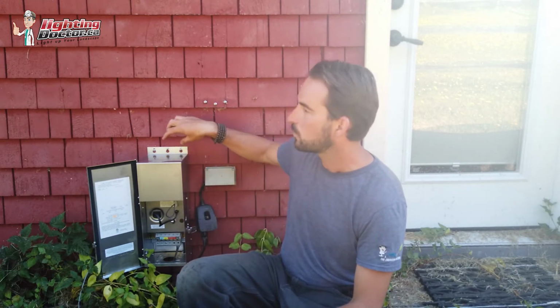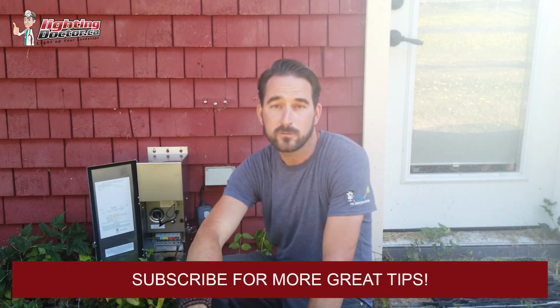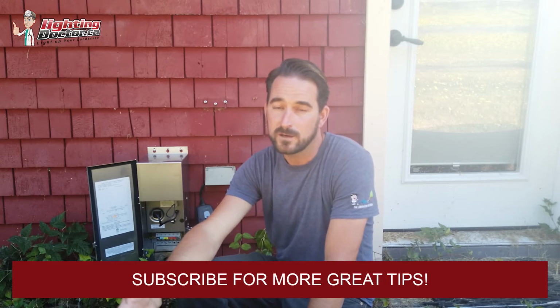But if you don't have that option, or your house is concrete, or you don't know what's there and you don't want to be drilling into the house, which I hate drilling into houses unless I know what's there, usually what I'll do is go get a nice 4x4 cedar post, because I know it's going to last. I might go to the deck section in my home improvement store and get a nice little cap for the top of my 4x4 post. I'll dig that in, bury it, and then I'll just mount my transformer to that. The reason I like doing that is because if you ever decide to move your transformer, you're not having to worry about patching up holes in your house. So a simple 4x4 post is a nice way to go and mount your transformer. It's clean, it's easy, and it eliminates you having to drill more holes into the side of your house.